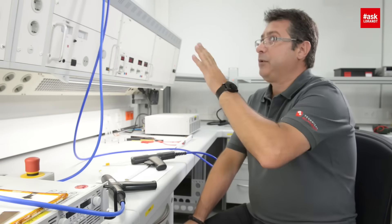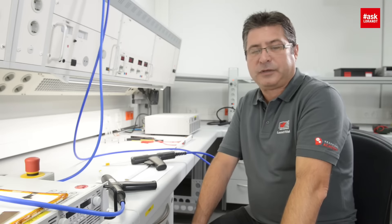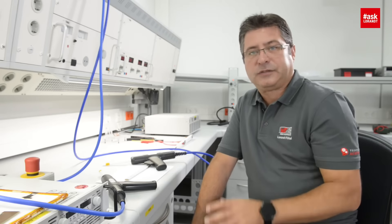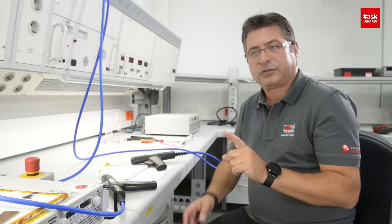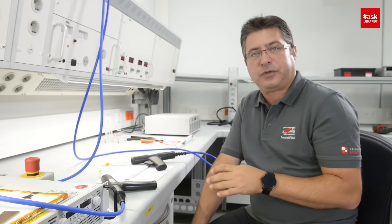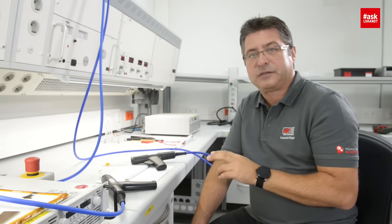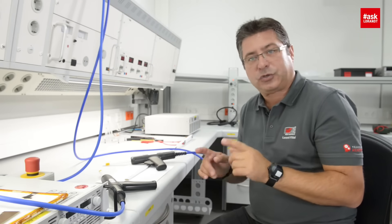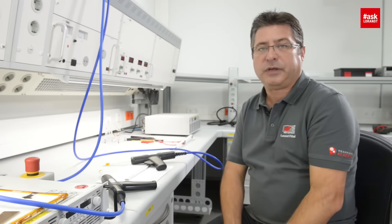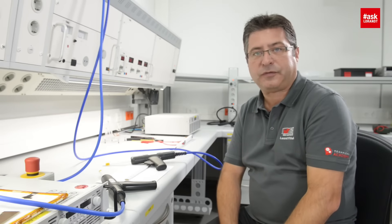First I will use a generator for 2,000 volts, and the second experiment will be 6,000 volts. It's very important that you take care not just of the pin-to-pin distance on the connector, but also that your pads and PCB tracks have enough distance, because the shortest path between two conductors will be the shortest way for a flashover.